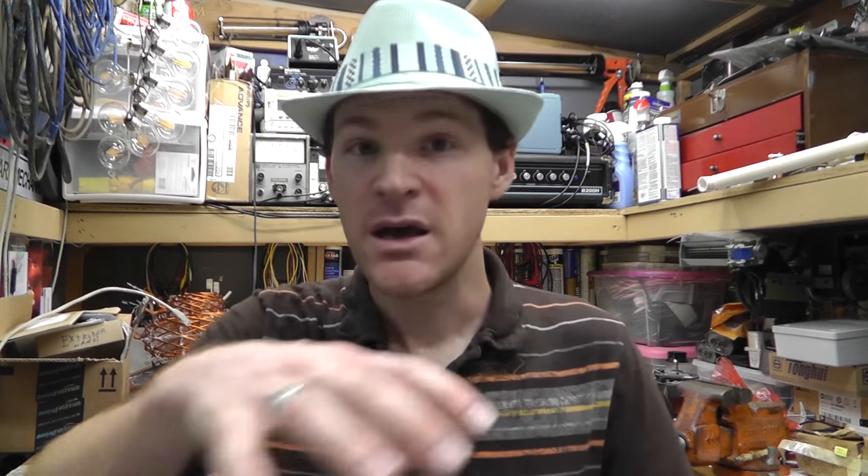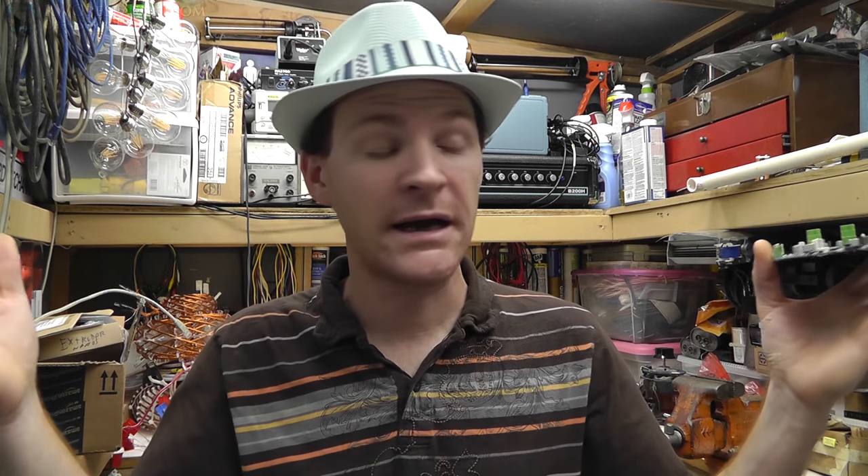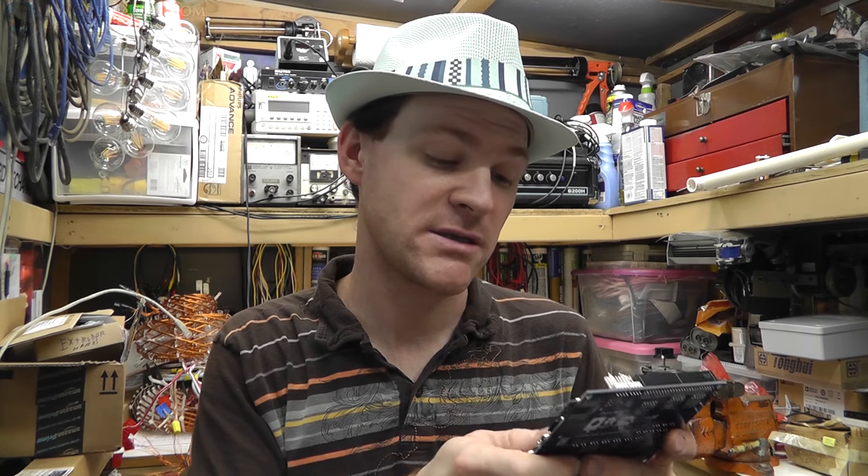In the near future, I believe they'll be integrating on-the-fly changing of micro-stepping. So let's say you're printing big infill and want to go really fast but don't have enough torque at small micro-steps — you could change that on the fly, then do the outside perimeter at really high resolution. I don't know all the details about resolution and steps; that's something I'll learn along the way. But basically it's just a totally different way of looking at it. At first glance, I like this thing a lot.